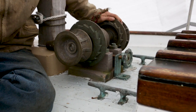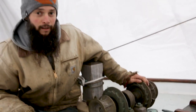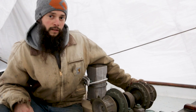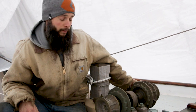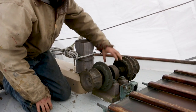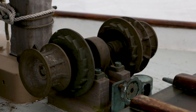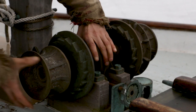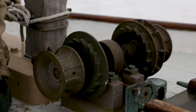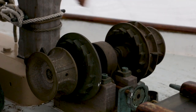This is one of the things that when we initially went and looked at Victoria and took a lap around, for me I was like, 'Yup, bingo — we will buy her basically solely for this.' This is a really old bronze anchor windlass. You would use this to raise or lower both of your anchors — it's super cool and genius, very simple design. In the center is this kind of friction device; you can control it by turning this knob, which right now is frozen and needs to be loosened up, but that would allow you to adjust how fast these rollers spin so you could control how fast your anchor goes out. This side has pawls for the chain, and you lift the cap off and the chain runs right down into your chain locker.